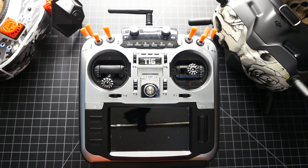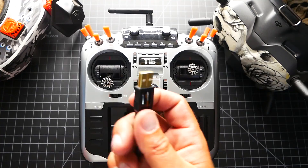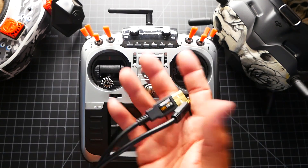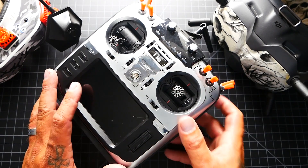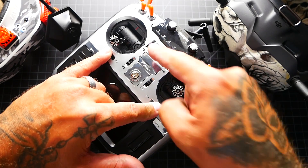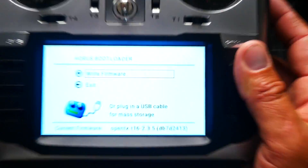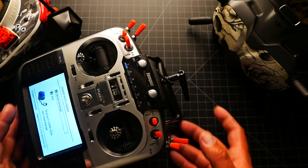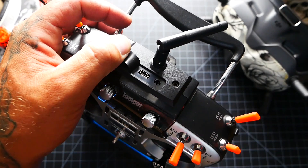At that point you need to plug in your radio. You will need a Mini B USB — it's USB-A to Mini-B. If you're not familiar, I'll drop a link in the description. To connect the radio to update the firmware and bootloader, hold T4 and T1 together, hold down the power button, then release. You will enter a screen that says Horus bootloader and write firmware. When you're in this stage, plug in your Mini B USB cord to the computer.